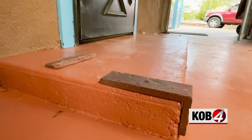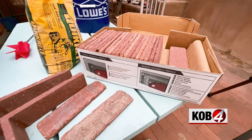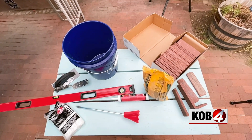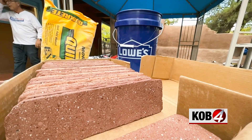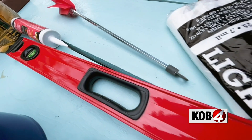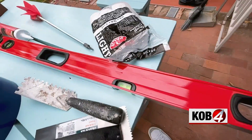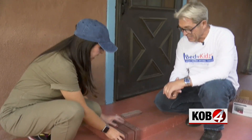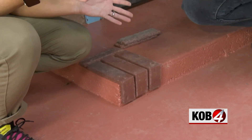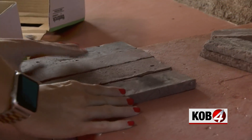I'm really excited about your idea that I never would have come up with. We're adding thin brick veneers to the concrete step, so you'll need those flat brick pieces and the edge bricks. Those edgers were only available online, not in stores, and shipping did take a lot of time. You'll also need mortar or cement adhesive, a caulking gun, a tile saw and safety glasses, and a tape measure. There are two ways to lay these bricks: the traditional way leaves a gap to pipe in and then grout between. But we wanted to match the patio bricks, where they're very tight together.